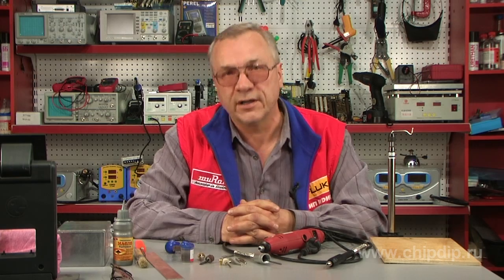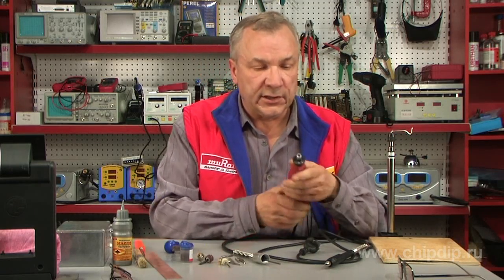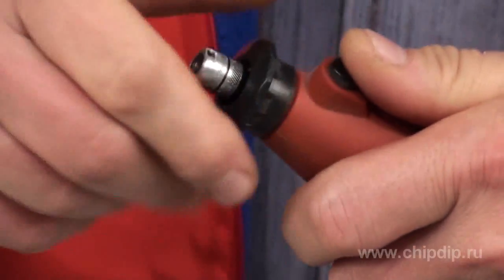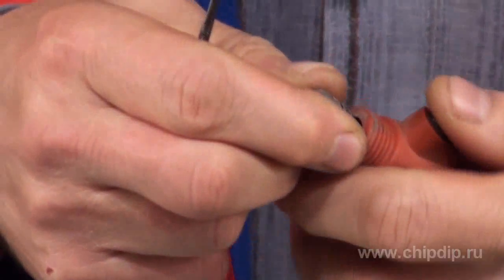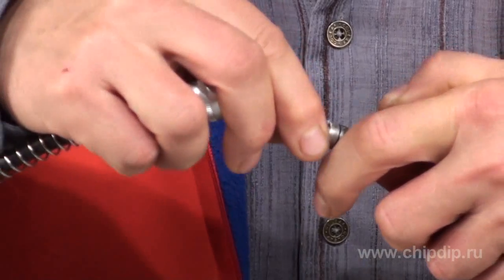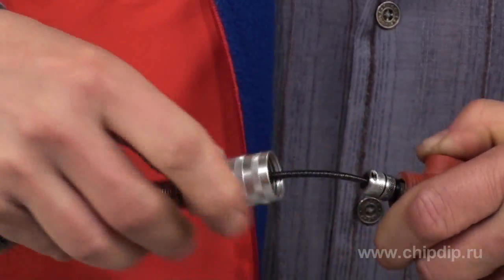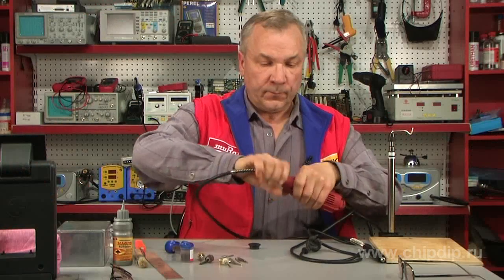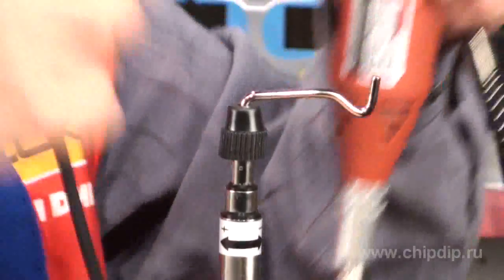Now we shall tell you in detail and show the main functions of the flexible shaft. We prepare the tool for the operation. First we remove the plastic coupling from the drill. Let's remove the retaining ring and insert the shaft into the opening. Then we clamp the retaining ring and fix it with the washer onto the frame. We hang the drill on the hook of a special stand, which is set somewhere in a convenient place, preferably on the left from the frame.